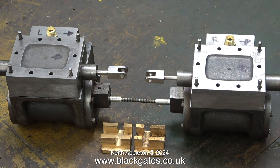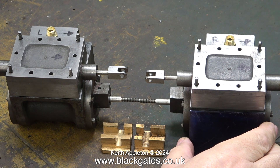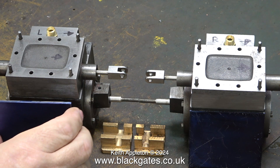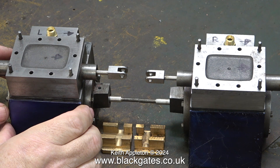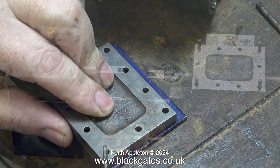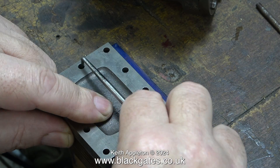If you are following this series about how to build a Blackgate Sweet Pea locomotive, you will wonder why I didn't build one from scratch. The answer is simple — there are two reasons. I wanted to avoid all the routine things like drilling the frames, machining the cylinders, and besides, I made a video about machining a cylinder previously and the process is identical for all cylinders really. Using a part-finished locomotive is good because I can repair parts that are not right, and this makes for a more interesting video series. In a previous episode I cut these two metal plates — these are going to fit over the existing damaged ports.